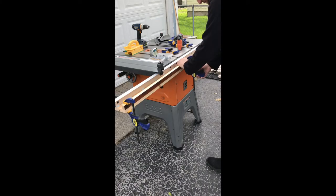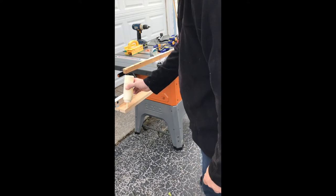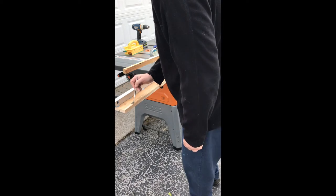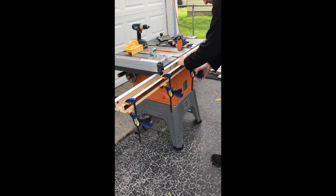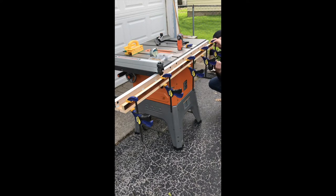Once our support piece was installed, I could start installing the rest of the fence pieces. I started by clamping the end piece down to make a mark and know where my glue area would be — clamped it in place, grabbed a pen, made the mark, and started adding glue. Once the glue was in place I reclamped the end bar, made sure it was flush with the outside of the support piece, then drilled in from underneath countersinking and added wood screws to hold everything permanently.